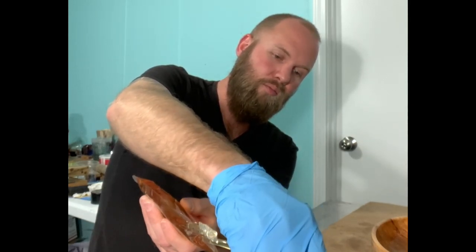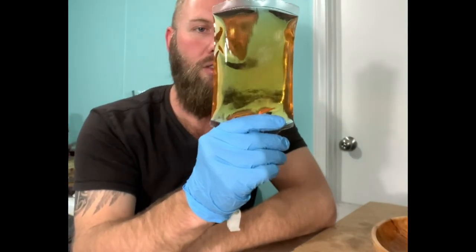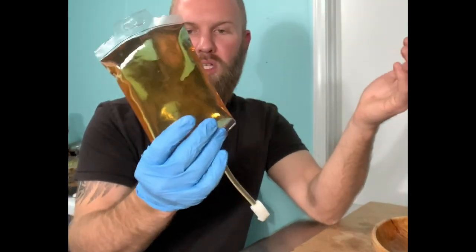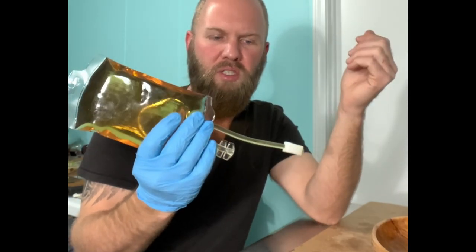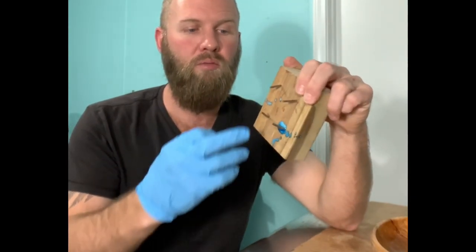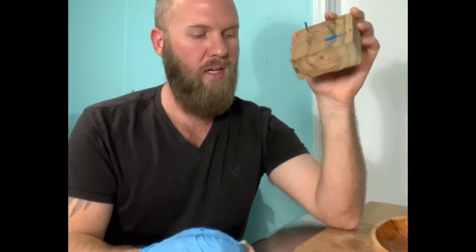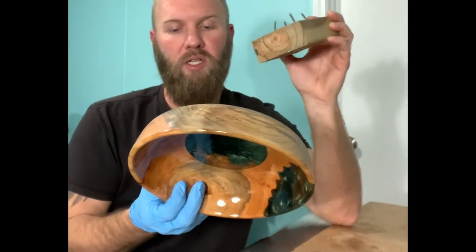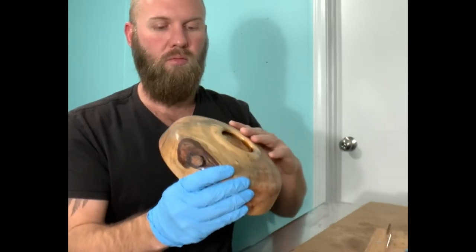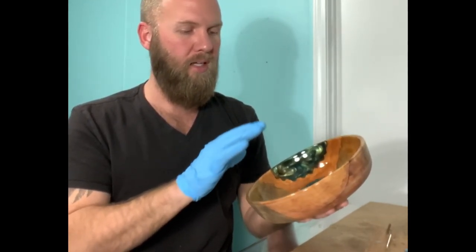They don't take much finish at all. See — just like that, no bubbles, no need for Bloxygen. It doesn't seep out of the bag. It's some type of food-safe PVC — they actually make these for little party gags where you can put liquor in for Halloween parties. Another thing I do is take a little tube of floor and put some nails in there, sanding the tops down. That way I flip the bowl over it during final finishing — I only do one side at a time so I'm not leaving fingerprints where the finish is undisturbed and laid flat.